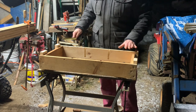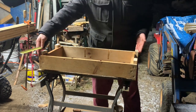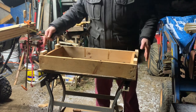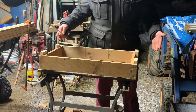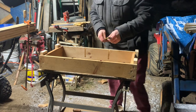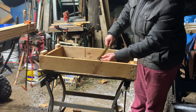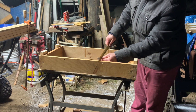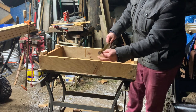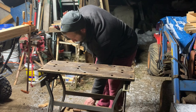Okay, so whenever we put our floorboards on here, we're going to have to pull this into square, because it's not naturally going to be square. It'll be close. My shelf boards, I guess I'm going to cut them 12 and 5/8 instead of 12 and 3/4, so I'm not getting too out of whack here.